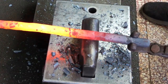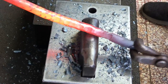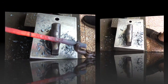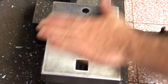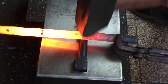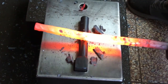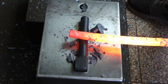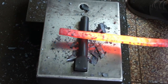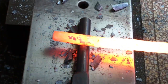It may start to look ugly but don't worry, it's effective. I switch to the smaller version and right away I can feel that this is even more effective. Some folks might ask why I don't use my fullering tool to draw out the piece, but it's just not the same striking force when compared to direct hammer blows.